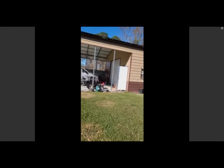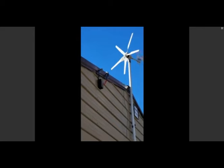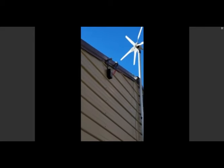And the way I brought those in is I brought the PV wires over the edge in conduit so that they don't rub and get through the insulation. So they're in conduit, and then they go into that box right there. Okay, and those unused plugs, I've got plugs in them so that no water can get in there. There's a gasket on the outside, and that goes through the sidewall, and I'll show you that.